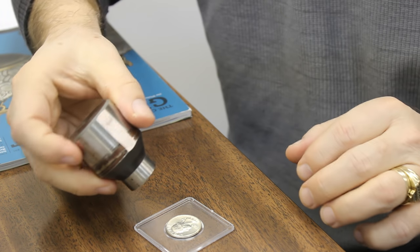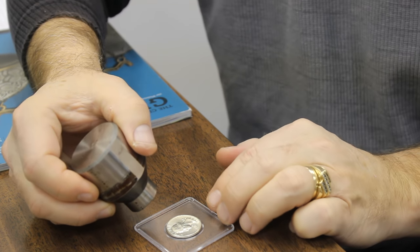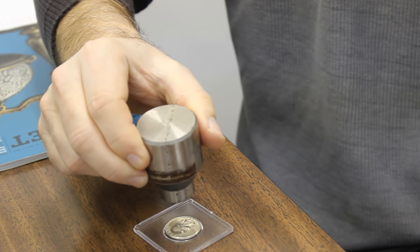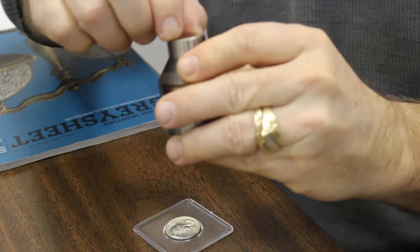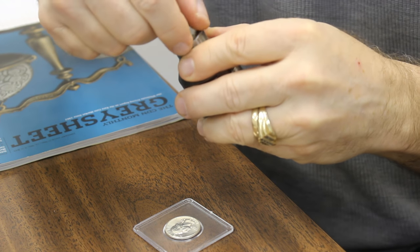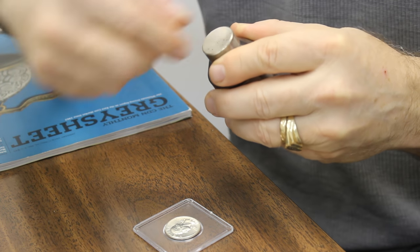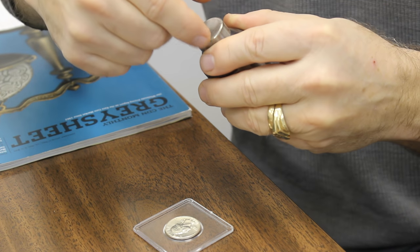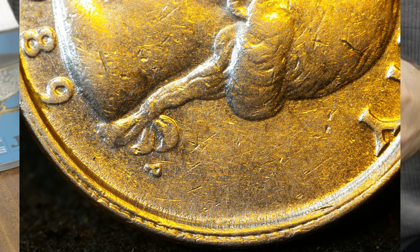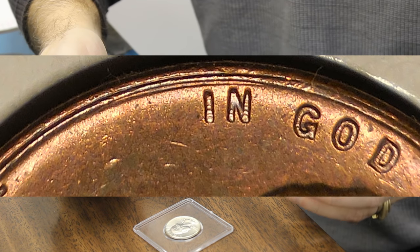Another thing to think about is when one of these pieces of the collar die is just off a little bit, or the die is off just a little bit and comes down at an angle and hits that collar die. On the top it'll actually put a little bit of a moon shape, or put little divots from the reeding — it depends on what coin it is. If it's a nickel or a cent, it doesn't have reeding so it'll be more like a moon shape. When that strikes a coin, you'll impart what people typically call a railroad rim or a double rim — which it's not a double rim. It's actually a clash — a collar die clash.